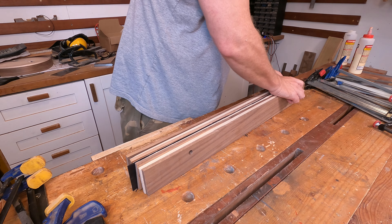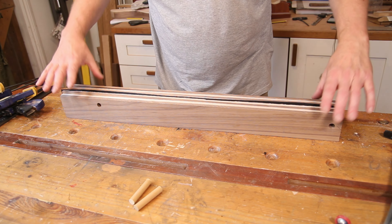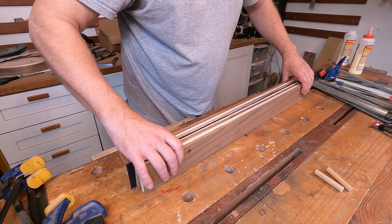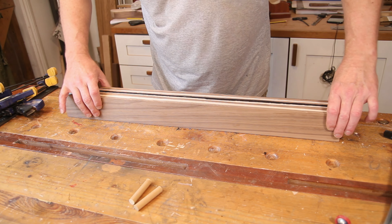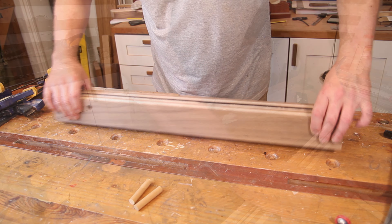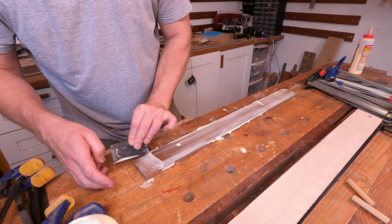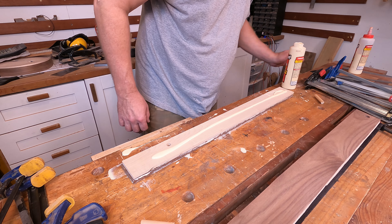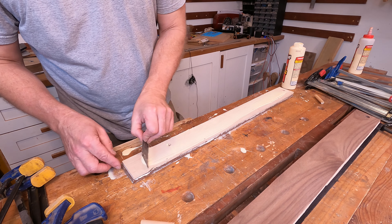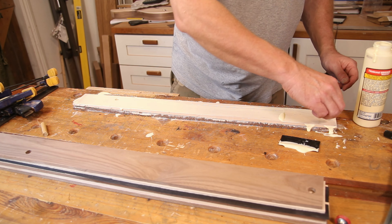As you can see I've drilled some holes through all of these and I've got some little locating dowels just to make sure they all go together as they should and keep everything nice and straight. It's quite a warm day today and this glue will start to dry quite rapidly so I'm not really going to mess around. It will be a quick and sloppy job but we can clean it up later — so it's just a case of getting some Titebond onto each piece, getting it spread out, and getting it located on the pins, then moving to the next one.